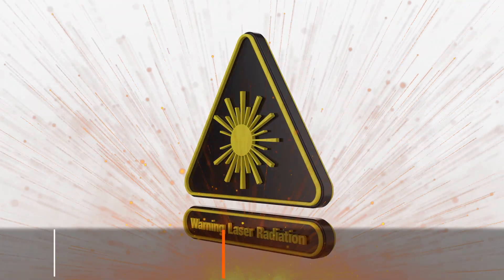Now you're getting a nice, tight, level surface consistently. This is an issue with some of these smaller systems — I'm not saying they're being unsafe, I'm sure they have protective eyewear and step back from the machine. But because you need a rotary for 3D marking and most of them don't have 3D scan heads, the rotaries are too big to fit under the door, so you have to operate the machine with the door open. Laser radiation is very dangerous — it will damage your eyes, it will damage your skin. It doesn't just hit what you're marking and stop; it bounces around. Running it with laser radiation blasting all over the room does a lot more harm than you'd think.